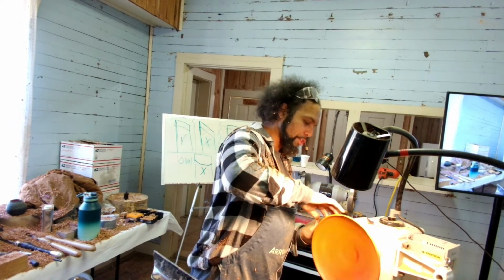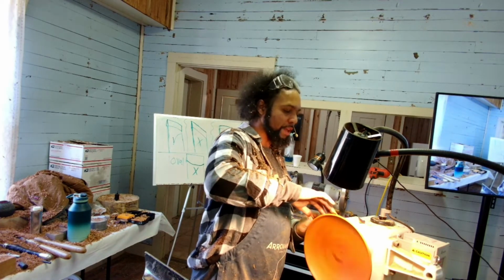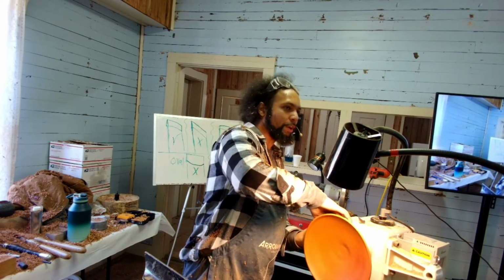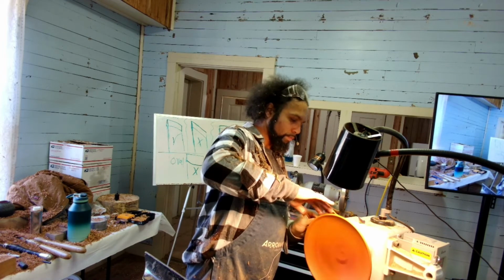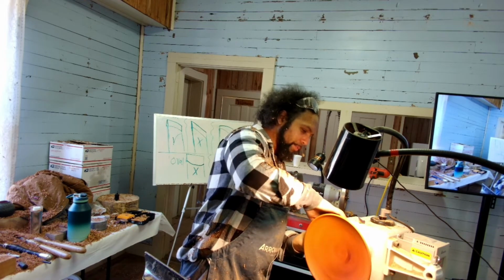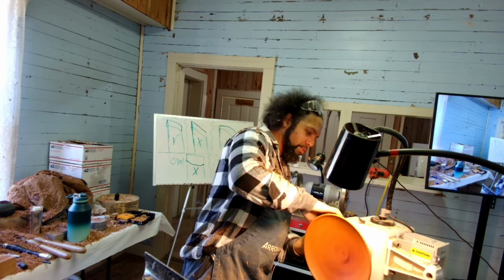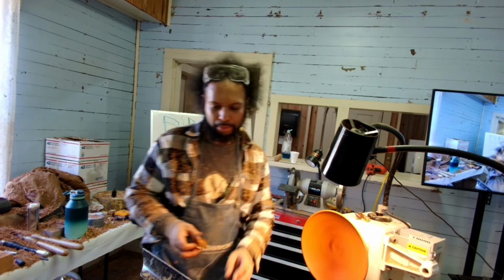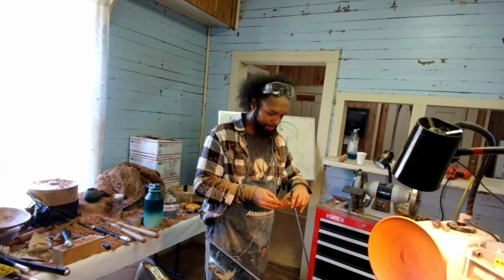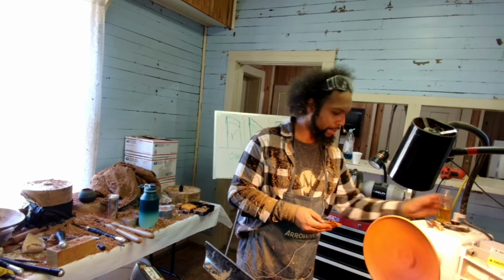So, a little bit of exterior sanding. Typically, when I'm doing this, guys, I like to make sure that I'm applying the oil and sanding at the same time. Okay? A little bit of oil and sandpaper. So I'll go from this to more of a finished grit, maybe 220 or 320. Actually, 220 will be better.